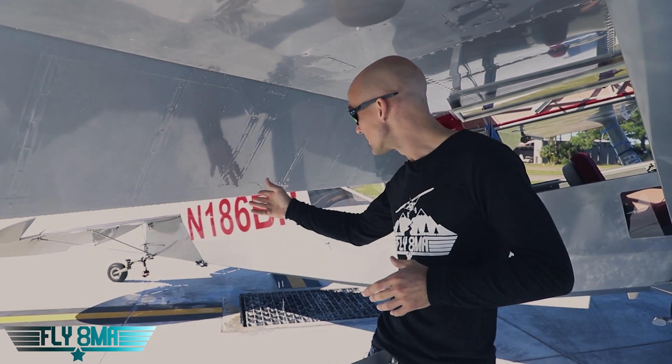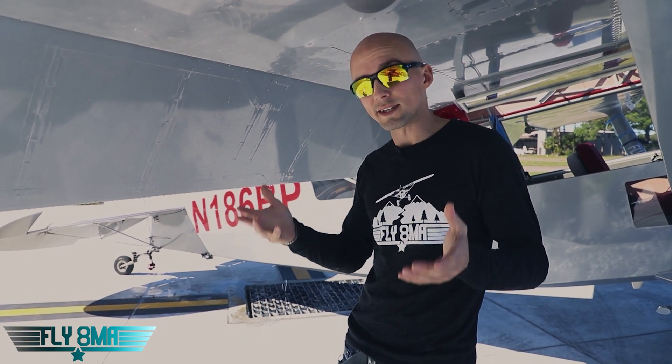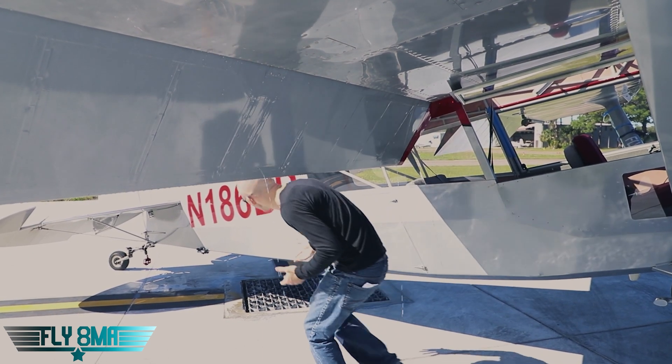Not only do you want to check on your preflight that drain holes are actually installed on the aircraft and actually exist in the first place, but on older airplanes where they obviously exist — like old 1960s and 70s Cessnas — you might want to check that they're still functioning, especially ones in the belly where they might get clogged up with dirt.